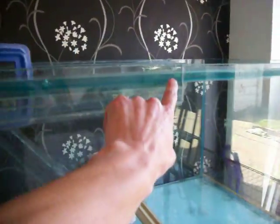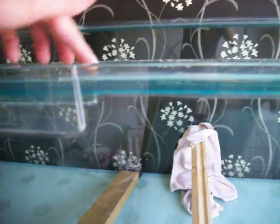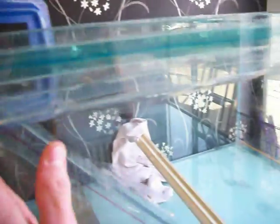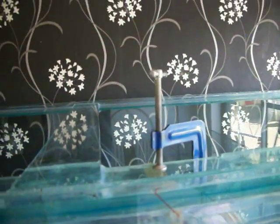To repair it, we've got a new 10mm seal — you can just see it here — that is three foot long, and that has been siliconed underneath the existing seal that has a crack in it. We've siliconed the new seal underneath, siliconed on top of that, and it's been clamped together for a few days so it's all set enough to support that. It's also siliconed to the face along here, giving extra support along the face of the front panel.